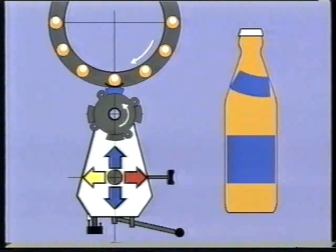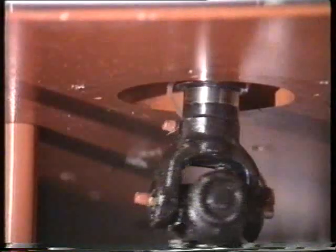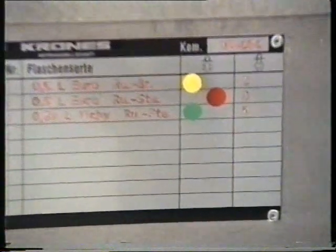The cross adjustment — the left-right adjustment of the cross slide — provides an optimal transfer of the shoulder label onto the conical part of the bottle. If the shoulder label is slanted, its position can be straightened by adjusting the cross slide. Rule of thumb for adjustment: the aggregate is always adjusted in the direction of the higher edge of the label. So if the label is higher on the left, the cross slide is moved to the left; if higher on the right, adjust to the right until the label is straight. If the universal joint shaft develops play after longer operation and the label becomes slanted, this can also be corrected by the cross slide. The new position must then be registered in the marking table.